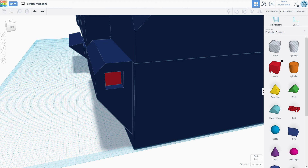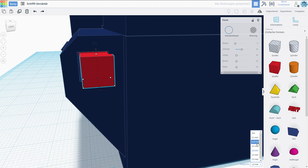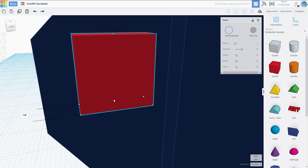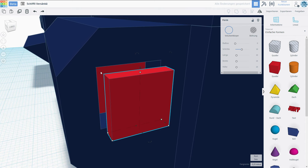If I remember correctly this is a 5 by 5 square, so let's create one of those. I'm gonna bring this right up to where it needs to go — let's go all the way down to 0.1 snapping. Now I fit this exactly into the hole. I want to make this approximately 1 millimeter thick so it fits exactly in there. I want to make this a tight fit, so we're gonna take away just a little bit — snap to 0.25 and go down to 4.5. Now this is gonna be a quite tight fit and it's gonna seal this hole.